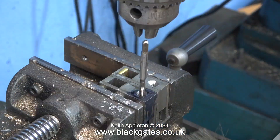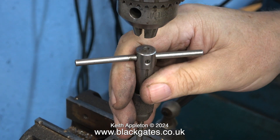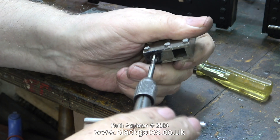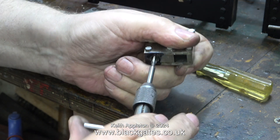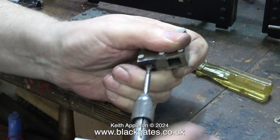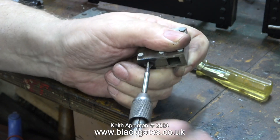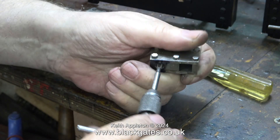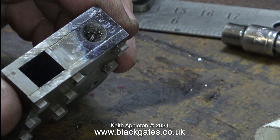So instead, using the chuck key I slackened off the chuck leaving the tap stuck in the work, wound down the table, and fitted a standard tap wrench. The small tap wrench is much more sensitive for a job like this. I was going to thread it in situ but instead I took the part out of the vise and held it in my hand — for the simple reason there's a bit of shock absorption in my fingers, but there isn't any when the crosshead is mounted in the jaws of a machine vise.